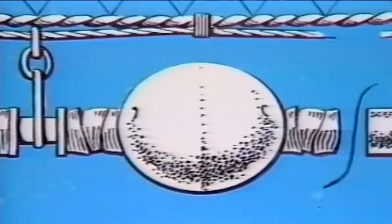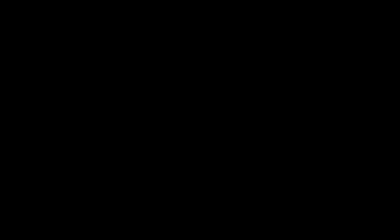Bobbins can be made of steel, solid rubber or plastic. Steel bobbins are used by the larger vessels; they are hollow to reduce their weight, but can become too light when worn. Solid rubber bobbins are also used on larger vessels, and have the advantages of retaining more of their weight when in water, and cause less damage to wooden decks. Hollow, plastic, free-flooding bobbins are much lighter to handle on deck, making them more suitable for use on the smaller vessels. Here we can see the gap between the fishing line and the bobbins when the two are made the same length.